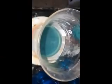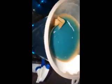Okay, so I've taken all the boards out, squirted them all off, and you can see the gold in there, there's tons of it. It's just packed. This is the bottom down here, all packed with gold. And the filters are both chock-a-block full of gold, and they're taking ages to filter through. That's probably at the height I wanted it to be, but I've still got this to go through yet. And this is watered down a lot because I squirted all the boards off, so I might not add this liquid to that because they're nice and concentrated, as you can see.